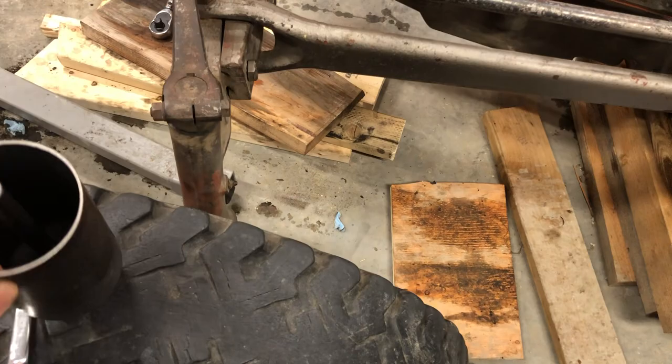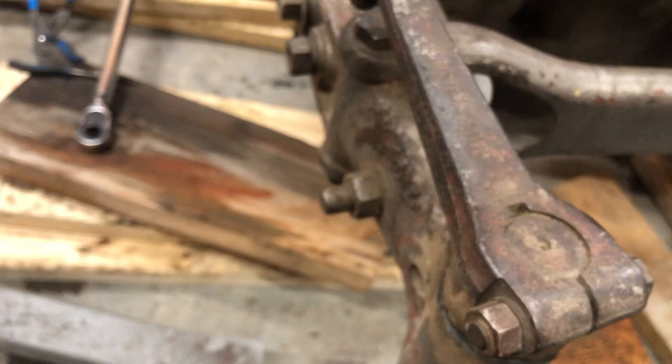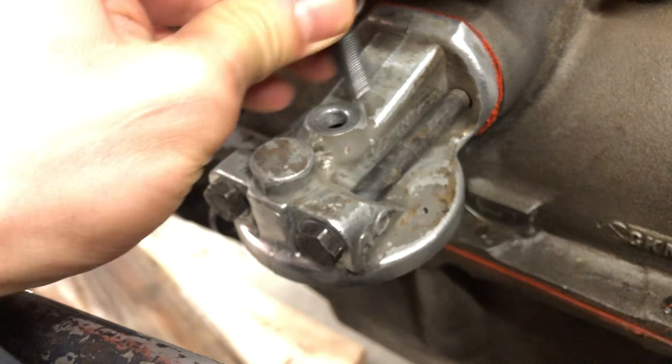This is an old tractor and I've got a stock oil filter housing still. The way it works is you get that insert filter — if you look down there, there's a little spring down there on that shaft, and then there's a washer that goes on top of that spring. That's supposed to help keep the filter from just dropping down. Then the filter goes down like this and the whole thing mounts onto the oil filter housing here.